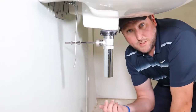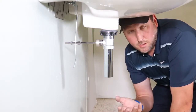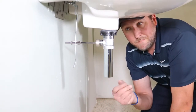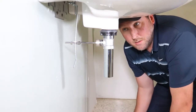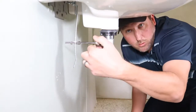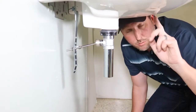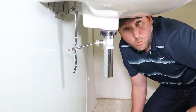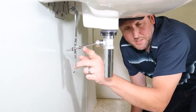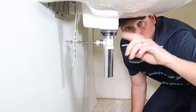As you can see, we've got a typical basin drain here. This is what they call a pop-up assembly. Now this one is even better than a lot of them — some of them are all plastic with plastic ball joints and plastic connectors. This one has several places it could leak. It's got where the ball rod meets here with this pivot joint that works up and down. When you lift the rod on the top by your faucet to hold or stop water in the sink, it lifts this strap, which is connected to this pivot rod, and pulls that drain down in the sink.